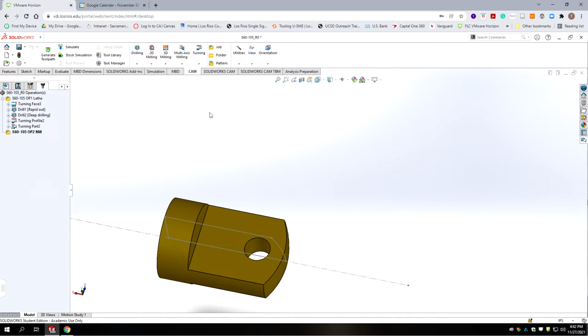distance. They've included a tool within HSM for that. They've got a couple tools here that help you with that. So here we have these two utilities that create a sketch. And there's the create spun profile. So if you needed a profile to follow, you could do that based off a revolved shape. It doesn't work very well unless it's a fully revolved.